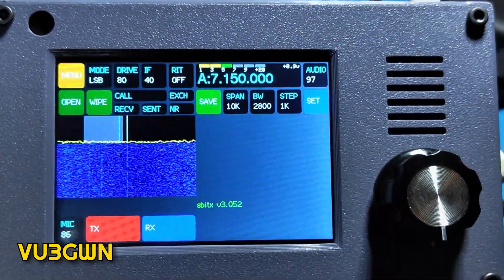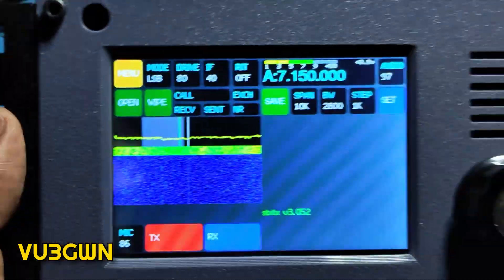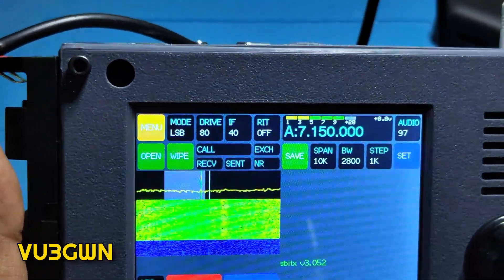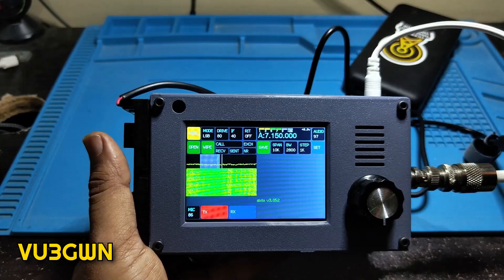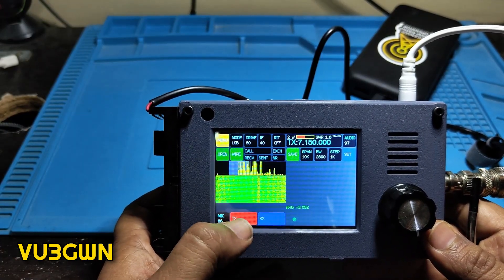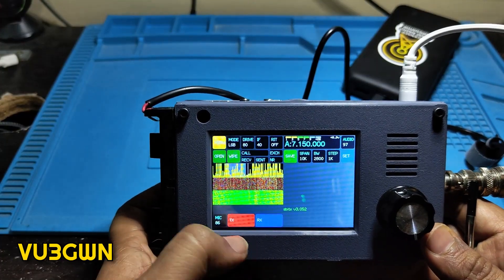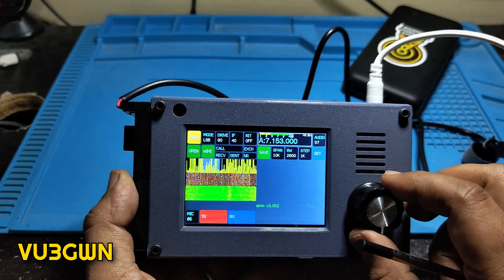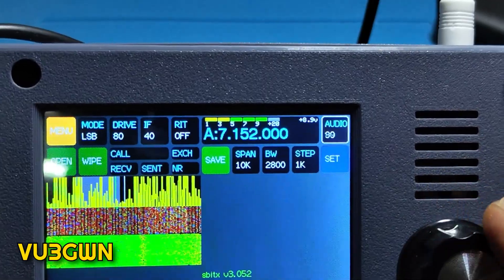Let me connect the antenna. Since it's in SSB mode, I still have to figure out a PTT mic. There is a mic socket but I need to check the documentation for what TRS configuration it uses. I tried the DL2 man microphone and the USDX mic and both did not work. Anyway, it's got on-screen TX and RX buttons — you press TX to transmit, say 'hello hello,' you can see the meter jumping, and then press RX to return to receive. It's not a toggle — they're separate buttons. To change a setting you need to select it to get a white square, then adjust.